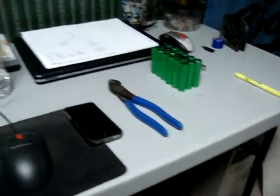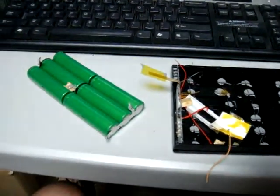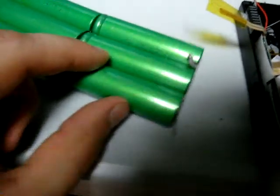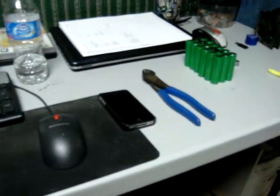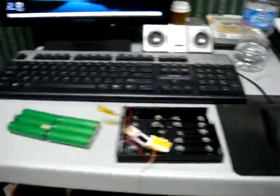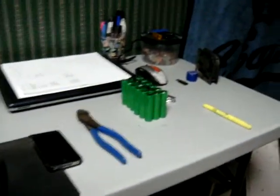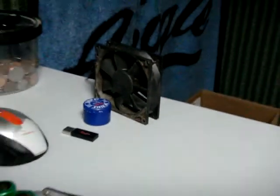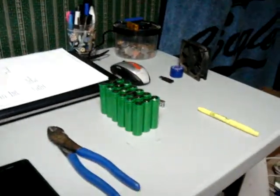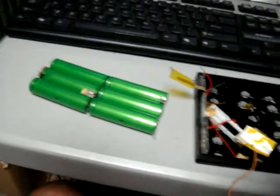With the amount of cells I have here, because they're 1.8 amp-hour cells, they have a little higher density than normal cells. They're Sony 18650 GRs. It's a little older stock, so I'm hoping they still have a good life — we'll have to find out. I ran them on this little 80mm 12-volt fan out of a computer power supply. It's also good for checking voltage real quick on the packs. They're hurting on voltage, that's for sure. So I've got to charge them up real nice and balance them before I build the batteries.